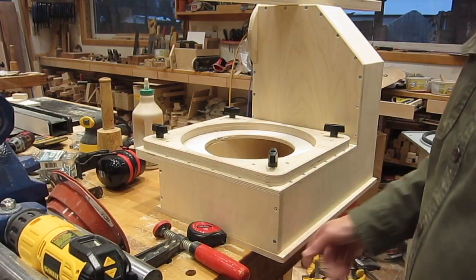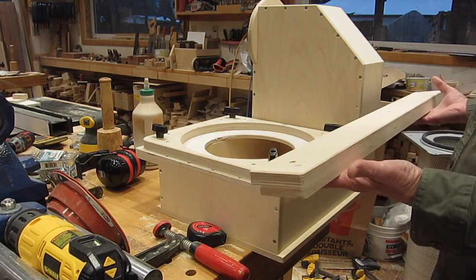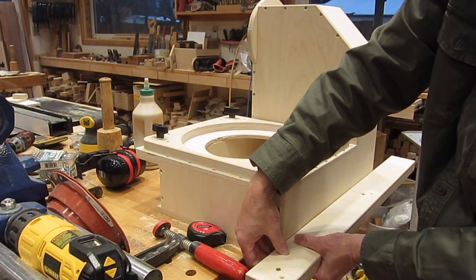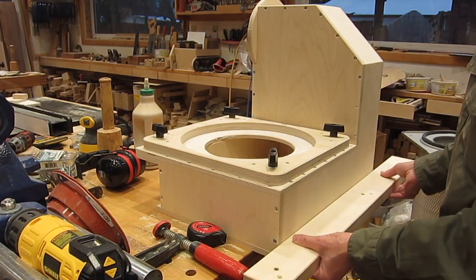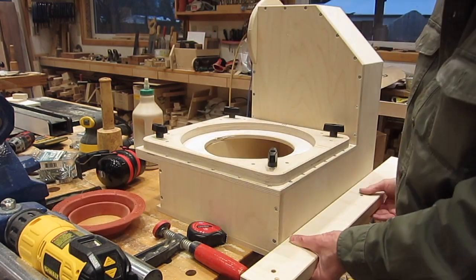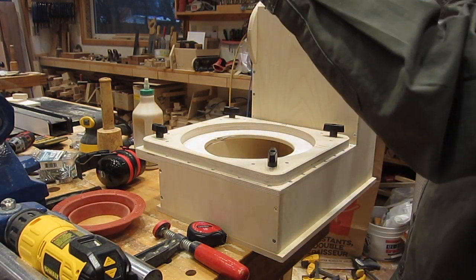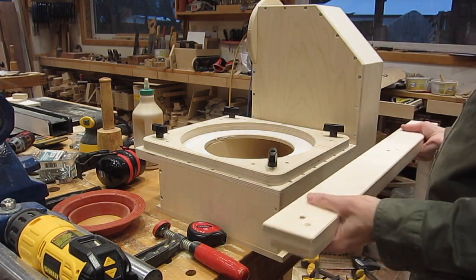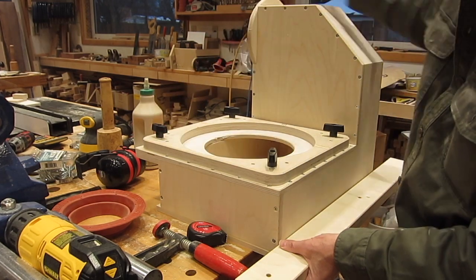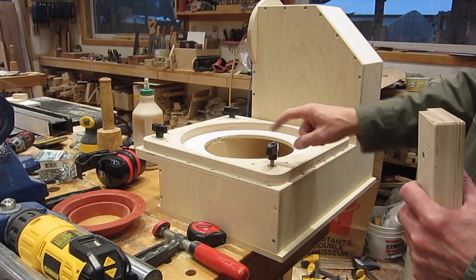The lid is attached and the whole thing is upside down right now. These brackets will be screwed to the ceiling, and then I can hook the box into the bracket and slide it along to line up with the boot on the blower. That's a lot easier than trying to hold this big box up at the ceiling, get it all aligned, and screw it in. I can mount one bracket in the right position, hook the box on, mount the other bracket, then slide it into position. These are the fasteners that will hold the filter in place — I've got them epoxied from the other side so they don't spin around.